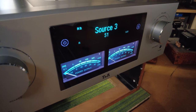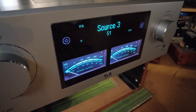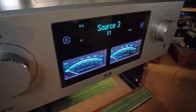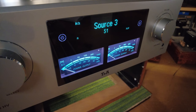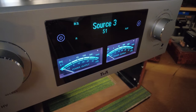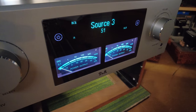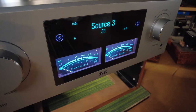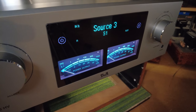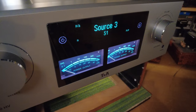This amp is in fact a dual mono design and we'll confirm that when we look inside. We're also going to be looking for the differential cascode JFETs on the output stage. They also claim they use discrete construction with no op-amps throughout the unit, which is interesting and unusual at this level. All this effort is essentially to get a sound characteristic that does not change throughout the frequency range — a tough tall order.